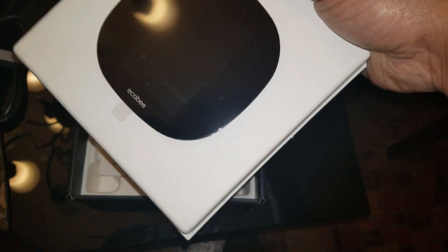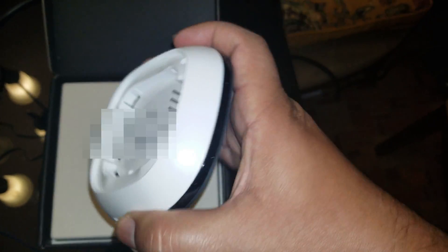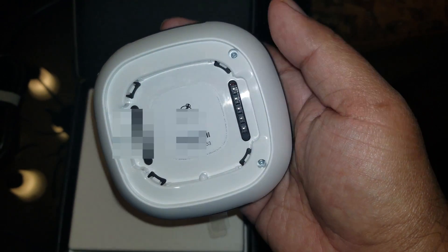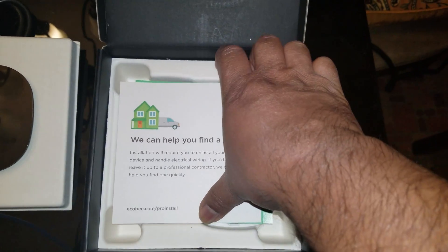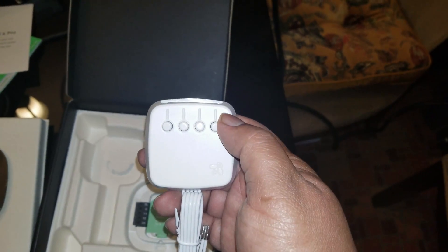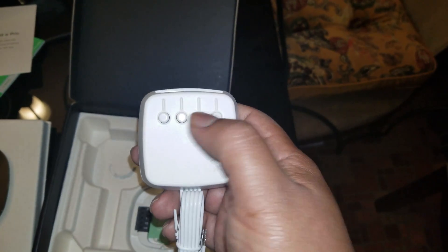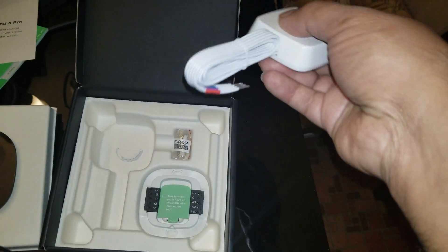Let's look at this right here — that's the Ecobee. Let's give it a flip and there you go. So the heating system we're going to be working with is a four wire system and it's missing the C wire. So here you go: one, two, three, four — you've got everything you need: your red, green, yellow, and white, and we can adapt that to this system and have a modern thermostat on it.